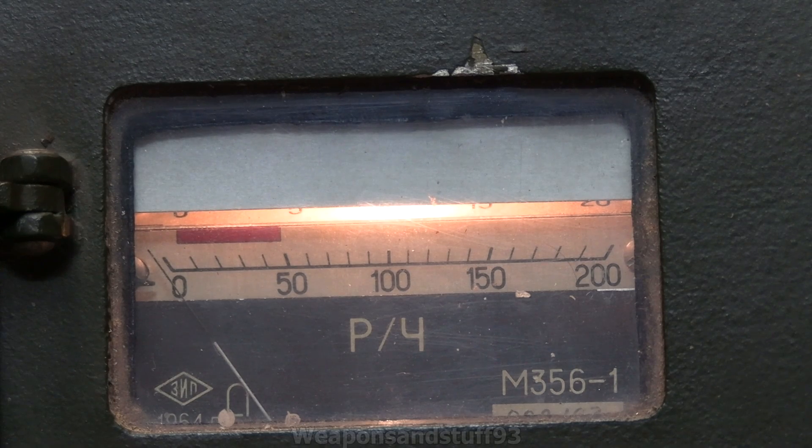I hope you've enjoyed the video on this. As said, it's pretty simple. I'm still recovering from the mumps so I don't feel all that great. Soviet DP2 ionization chamber or radiation detector — roentgenometer, whatever you want to call it — dose meter would technically be what DP means. So Soviet DP2 dose meter or dose rate meter, zero to 200 Roentgen per hour range, the thing that came before the DP5. The advantages over the DP5 would be it actually does measure pure ionization as opposed to a dose equivalent like a Geiger counter does.